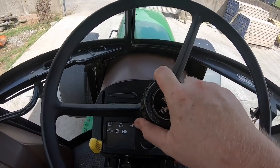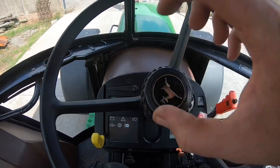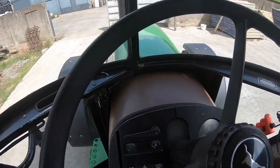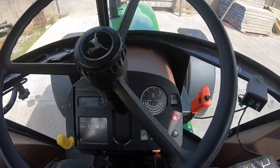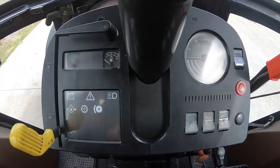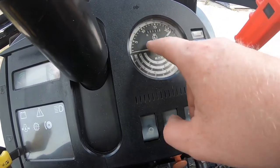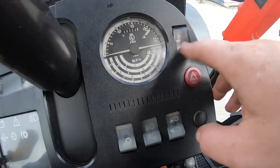There's a telescopic in-and-out adjustment on the steering wheel, adjusted just by twisting this here - it pulls the steering closer to you or further away depending on what you're doing. There's also a lever so you can move the steering wheel up and out of the way for getting in or out, or depending on your sitting position. The clocks are very basic and straightforward - just an analog rev counter which has all the gears kind of built into it, so depending on the revs you're doing it tells you what speed you're doing. There's nothing digital on this.